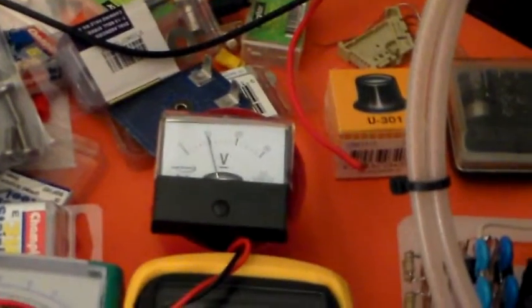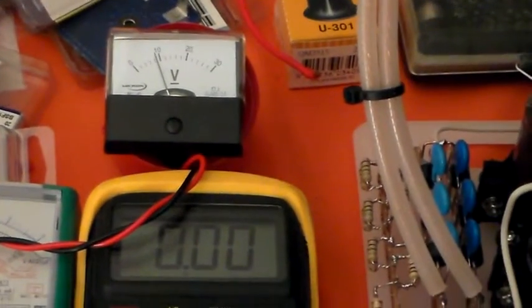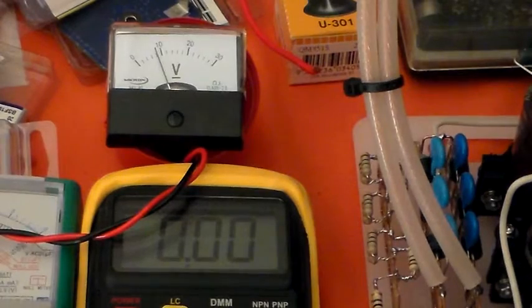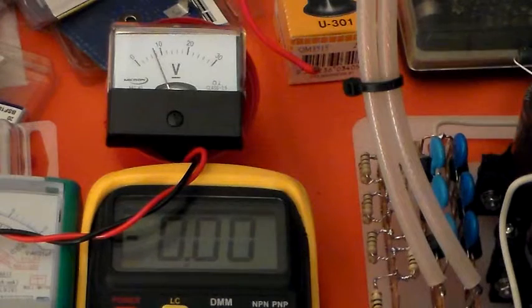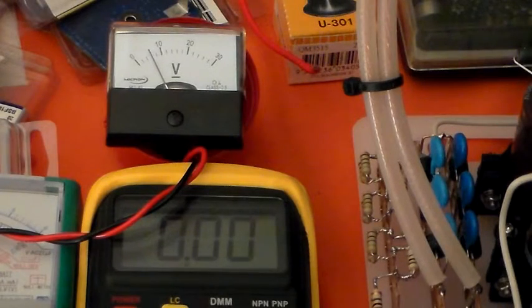So now we go back to our metering. My metering is down here amongst all this rubble. I'm sort of preempting the inevitable explosion, of course. Now it doesn't matter that the HT voltage hasn't gone to 0, because we're not really interested in the inrush, we're only interested in the HT voltage. So remember now, when I turn the mains on, the resistors will not be taken out of circuit by the relay. They'll remain in circuit.